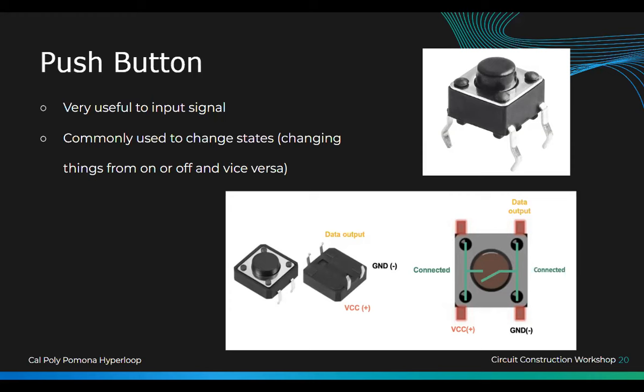If you don't ground a signal over here, you just have this floating in the air, it doesn't know whether it's actually fully ground or somewhere in the air. There could be some static charge that could change the value. So you'd use a 1 kilo-ohm resistor or so down here to the ground. So make sure that you are going to ground, and you're not consuming too much current though. Does that make sense?